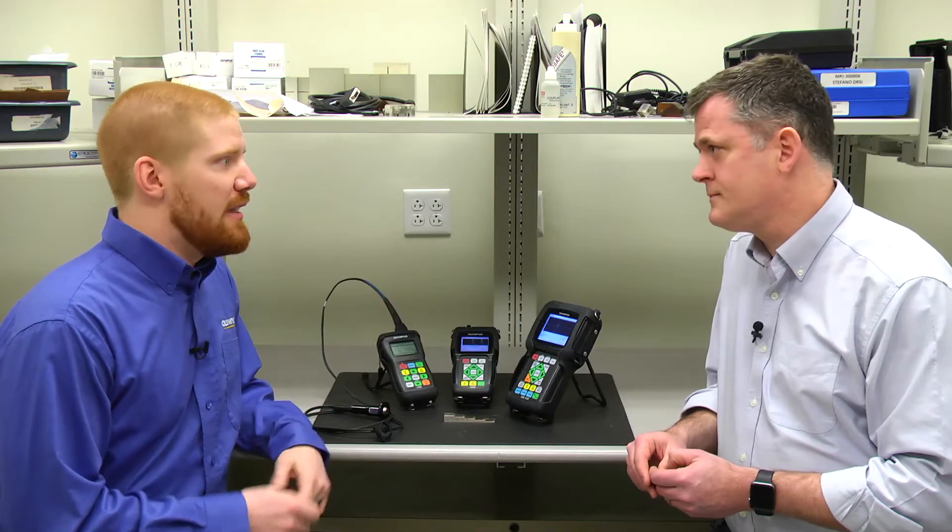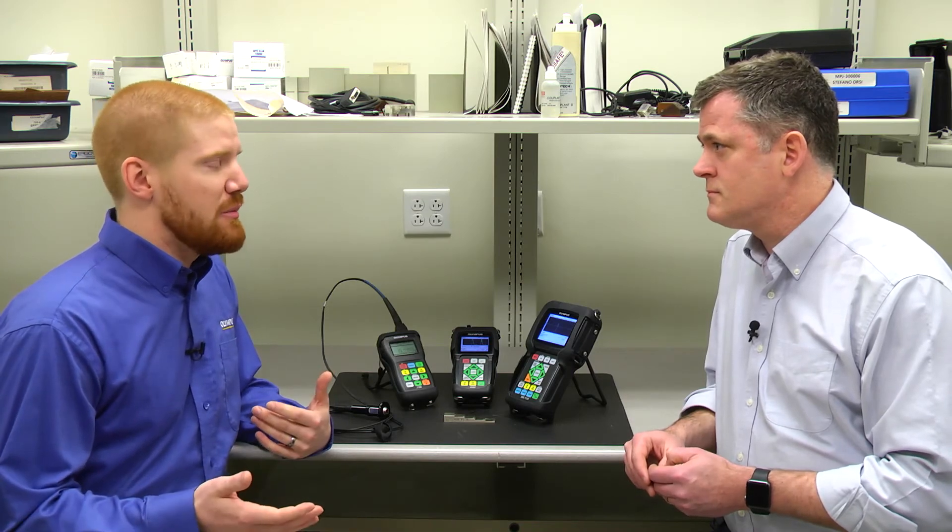With the single elements, because they're used on a variety of materials, you do have to tell the instrument what probe you're using, and then you may need to make internal adjustments from there. The majority of the time, the default setup will work — you'll calibrate to your material and you're good to go.